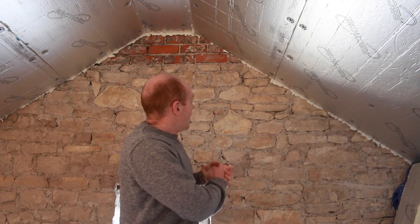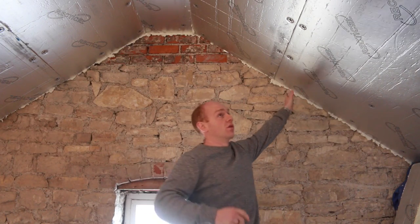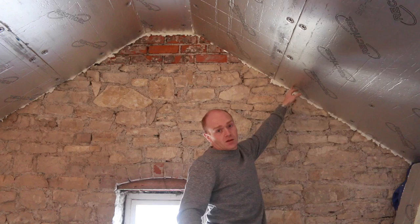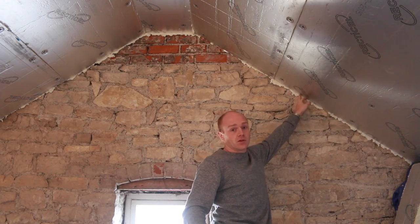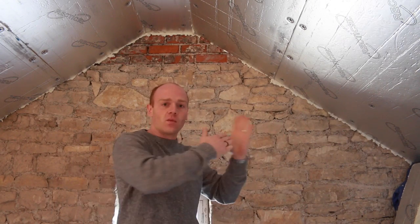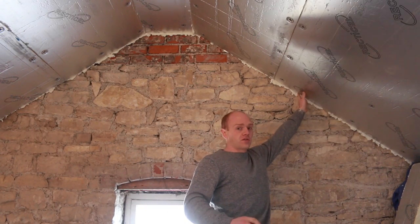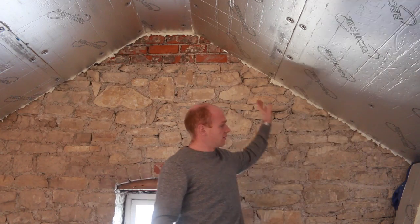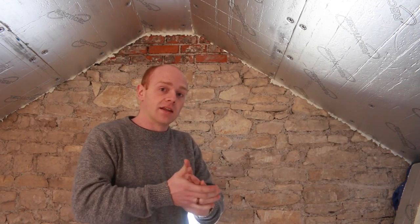You'll notice we brought the boards all the way along because obviously the pitch roof joins onto the gable ends, but the boards, rather than scribe them to the stonework and have a bit of an air gap, I have used some foam in there. That's only about 50mm deep. It's obviously not breathable, but I think for that small sacrifice of having it wedged against there, it's going to give a really nice seal. And then obviously we'll need to take the plasterboard across to the wall as well. So that's what I've done there to seal the insulation to the walls, but I'll show that in detail in the next video.